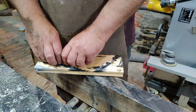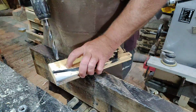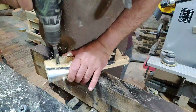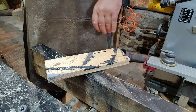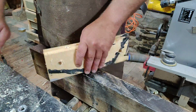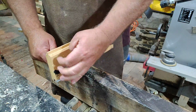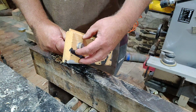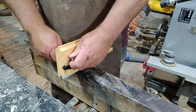And there's a few things we need to think about when doing that. One thing you don't want to be doing, because this is what he was doing, is you get your drill, drill a hole. Oh, wonderful, I got my hole. And then he thought, oh okay. Well, he knew he needed to countersink it, because what he didn't want is the washer and the bolt and the nut all sticking out, so people get caught on it. It looked untidy. They want it all countersunk so it's flush. This was in an oak beam in a French farmhouse.